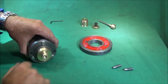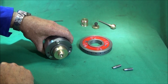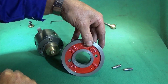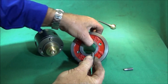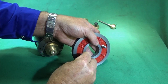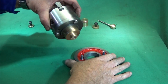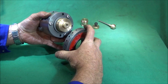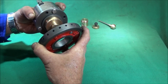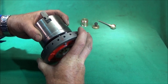What I've decided to do instead is utilize the holes that are already in the Chinese mini lathe back plate, use a transfer punch to mark the holes on the indexing plate, and thread those to 8mm. I've made up a couple of studs which screw in there, and these will hold the chuck in position on the indexing plate and stop it from moving, but I can also take it off whenever I like to clean the chuck or use it on another machine.